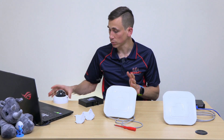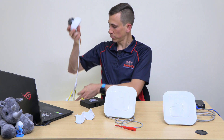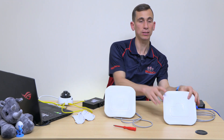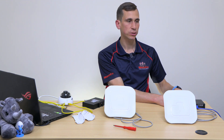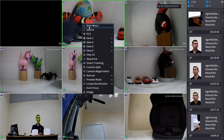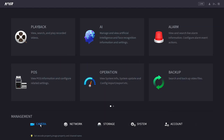The wireless side is completely done. The next step is configuring this IP camera on our recorder. The path goes from camera to switch, across the wireless bridge from receiver to transmitter, then down to the network switch connected to our recorder. On the recorder I right-click, select main menu, log in, and then select camera.